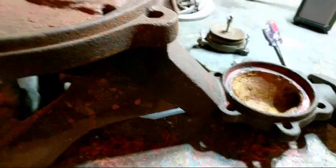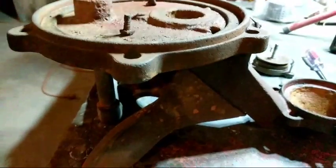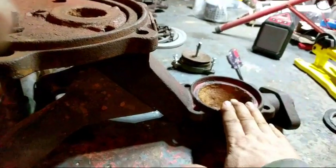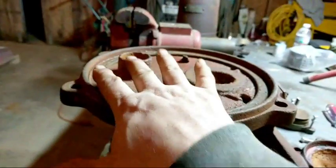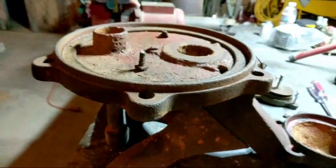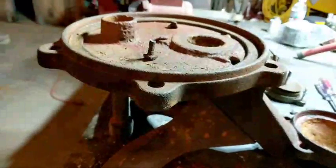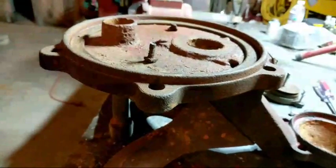So this is a double-acting ram. You could pump your low-producing spring water, say it only produced a half a gallon a minute, with a 25-gallon-a-minute creek. The creek would run the ram. It would pump up, this would be flooded with spring water, and you could actually pressurize a bladder tank, take a shower just like you do today, crank it up to whatever. I've made 180 psi. It'd blow the fixtures off your sink. Not that you want to do that, but it can do that.